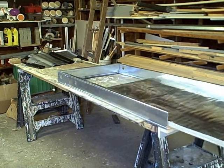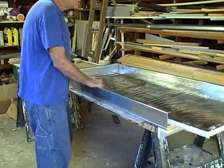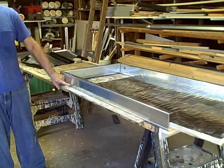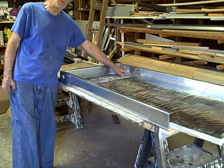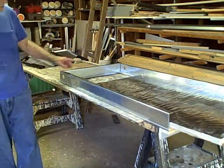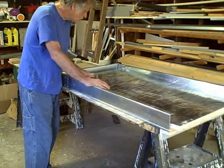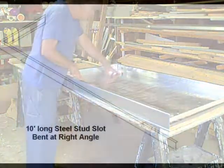Sometimes it's better to make this a little shorter. It doesn't have to fit that tight. But one of the problems we're going to have is that we're using sheet metal screws and they're going to be protruding, so we'll have to push the insulation down over them. That's another reason why it's good to use pop rivets rather than sheet metal screws, but it doesn't matter that much for our purposes. We'll slide this insulation over the top of the sheet metal screws like this, and then we'll just push it down.